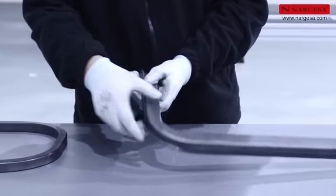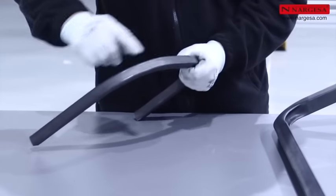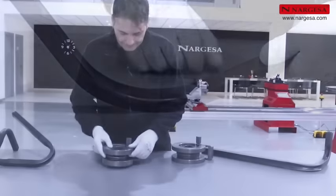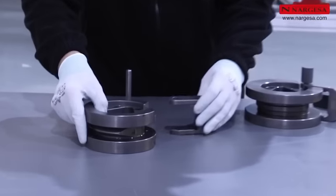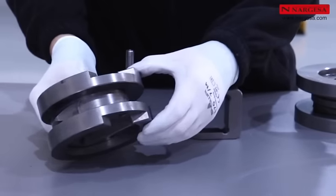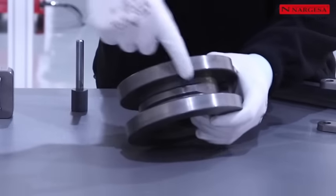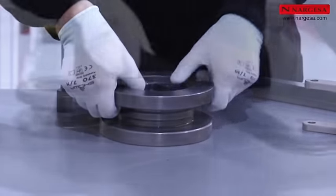There are two types of bends for square pipes, one with an inner groove with a small radius and another without any grooving, yet obviously a larger radius. Dies with grooves are made with an ascending ramp to minimize deformation and get a good industrial finish. Depending on the customer's needs and the piece, we can produce a die with more or less controlled deformation on the inside.